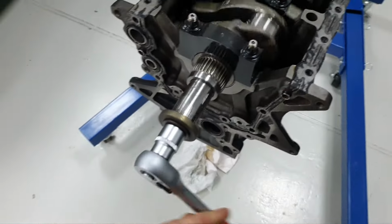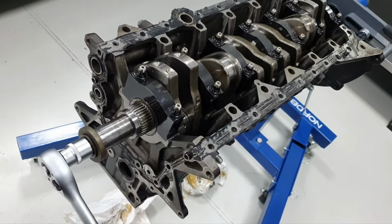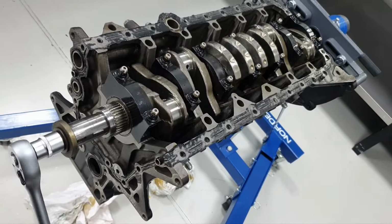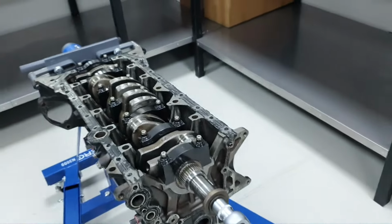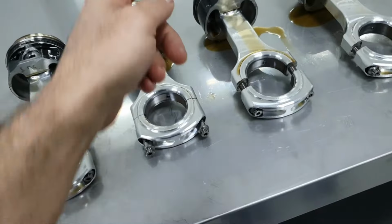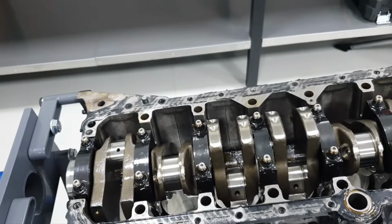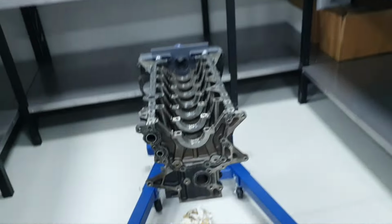Now, the crankshaft. It spins beautifully and I can make 360, it doesn't stick anywhere, that's a good one. Let's open also the crankshaft. The connecting bearings need to be replaced, but the same thing can happen again on the upper one, especially now that I'm going to change the piston rings and remove the glazing from the cylinders, that's for sure. Lovely. Crankshaft out.